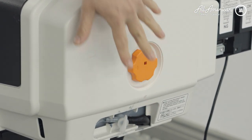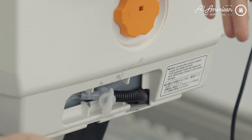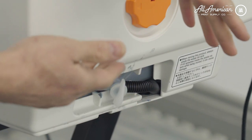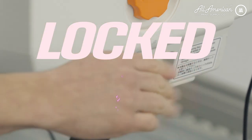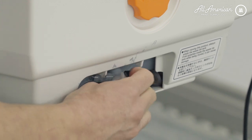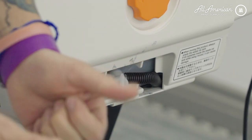While on this side of the printer, let's touch on the waste tube. You should have a bottle handy as your MSM on your computer will let you know when it's time to empty the waste. This knob here — when in the upright position — is going to be locked; if we turn it to the sideways position, the ink will begin to flow waste-wise. Just make sure you pay attention to your MSM as it will let you know when to empty this, and have that bottle handy.